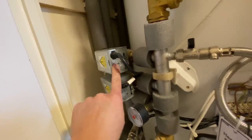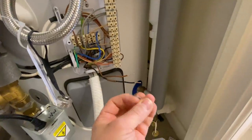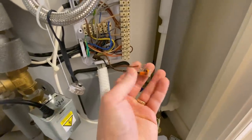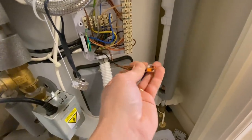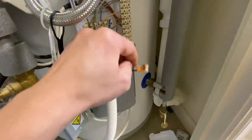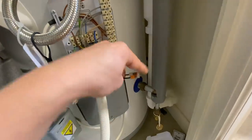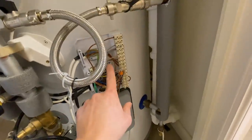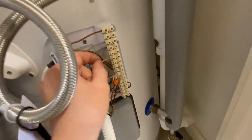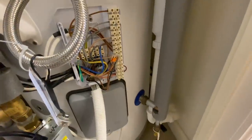That brings on the valve. I've worked out which is what — zone one is upstairs, zone two is downstairs, that's the hot water. I'm going to leave these old cables in a Wago, leave them in here — we're not going to rip anything out because it's always nice to have a cable going somewhere. We'll mark it up as not used anymore, and then we'll just fit the new Hive thermostat over the front. They have actually cut a box in for me which is nice, so we can just screw that to the box. The new receiver cables that come down here will come along and into here, and it will just switch on the valve — it's like a wireless switch, basically.